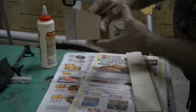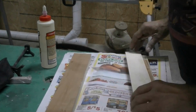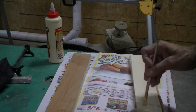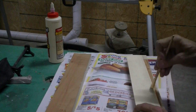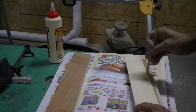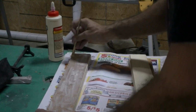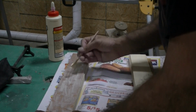The top of the neck is going to be down, and I'm purposely putting that down so I can line the boards up good and flat. You could probably get away with only putting glue on one side, but that's not how I roll. I like to make sure there's really good glue coverage. I know from lots of experience that good coverage and good clamping is the secret to good holding. It was actually less work to make this out of a single piece than it is to do it this way. I know that. It's just not how I do it.